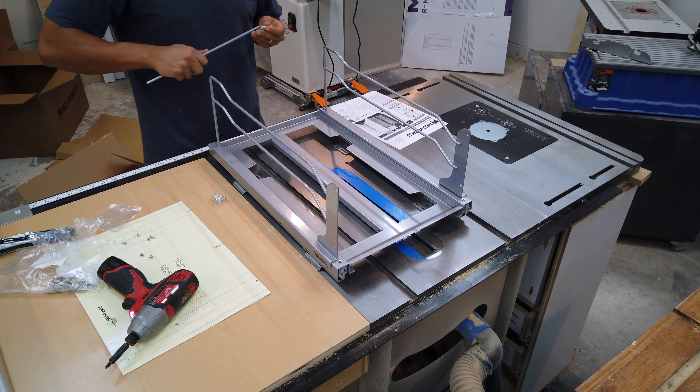Now that the cabinet carcass is done, I'm going to focus on the next part of the build, which is to make the frame of the cabinet. So to make this, it's basically just my two stiles and then my rail that goes at the bottom. In between are my panels, which are cedar planking. I made these corner pieces using the lock miter bit and I made a groove down the middle of the stile. The groove accepts this quarter-inch planking.